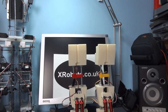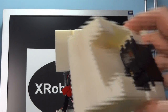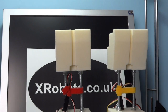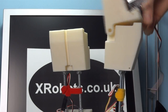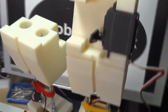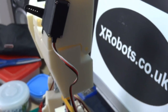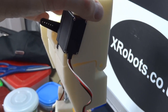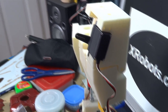Let's have a closer look at the top half of the knee. It's another piece that fits and hinges on there. As you can see there's a servo mounted in there which will pull a tendon down the front to the anchor point. I've offset the hinge at the back, so when the Android is standing upright the knee will lock and hold its position without any force being applied.